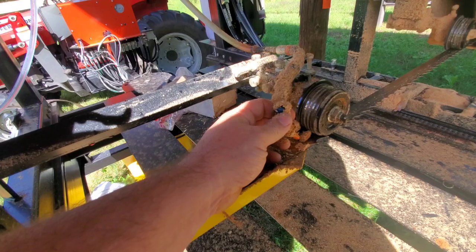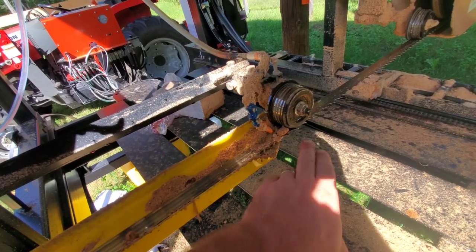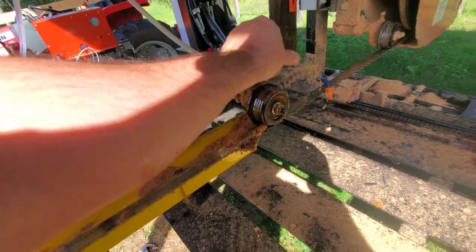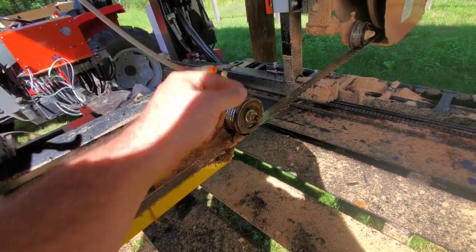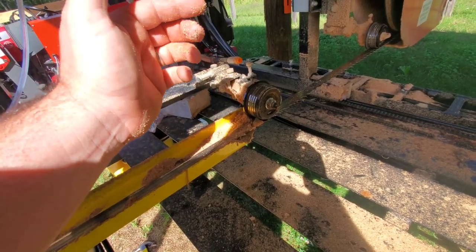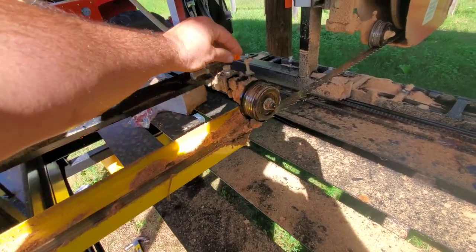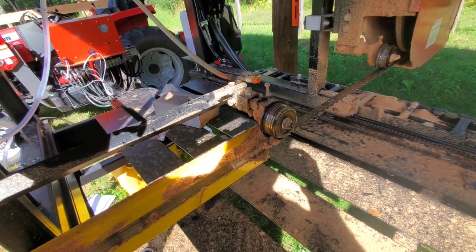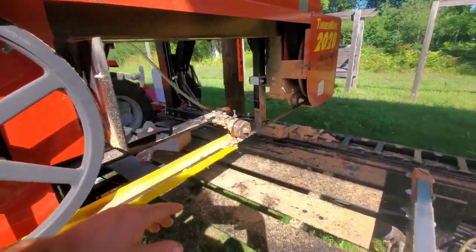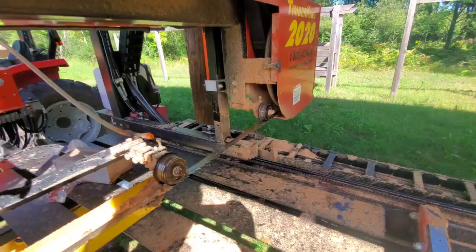I put the water delivery system on this side of the bearing. Be careful — if you're running soap and water, you can get water into the bearing and wash out the grease since it's a detergent. Some people run it on the other side. I run it on this side to maximize my cut throat. If a blade blows up, the water fitting will pop off rather than break. Also check the other bearings — if they're hot, you may be low on grease.